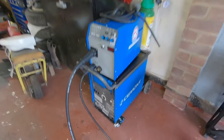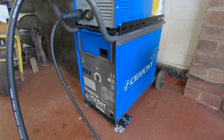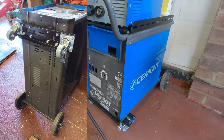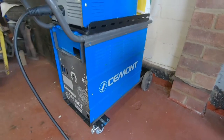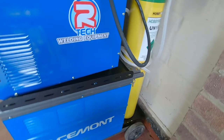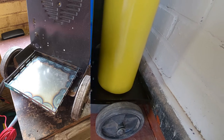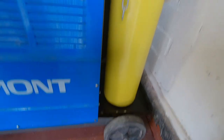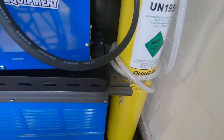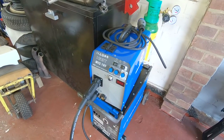So there's my new welding setup. My old welder has been down-cycled and has now become a welding trolley — I made a new front axle from some angle iron and casters so I can wheel it about flat. One of the casters locks so it can't wander off on its own. There's a new flat-top tray on it with side pieces to stop the new welder falling off. I also added a plate with rails around the back so the gas bottle stands up square and fully supported, with the chain still there to hold it on.